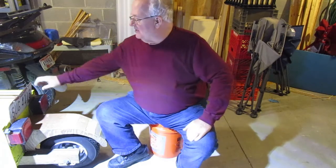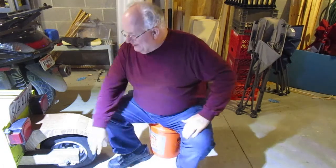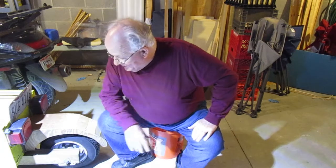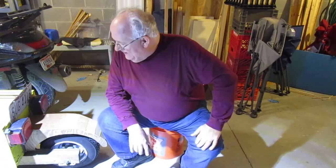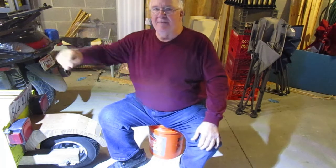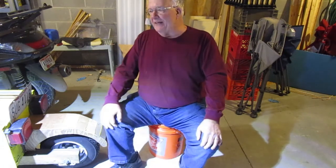The box itself is mounted on 2x4s, and what I did to assure that the 2x4 wouldn't split on me is that I got an angle from deck building hardware and set it on the underside. The axle goes through it on the back side, so the pressure is here all the way to the bottom, and that isn't going anywhere. The 2x4s are fastened to the underside of the trailer body, not directly to the front where the hitch is. Trailer lights and a license plate, because the governor of Ohio always wants his kickback. If it's got a wheel on the highway, except for special circumstances, it's got a plate.